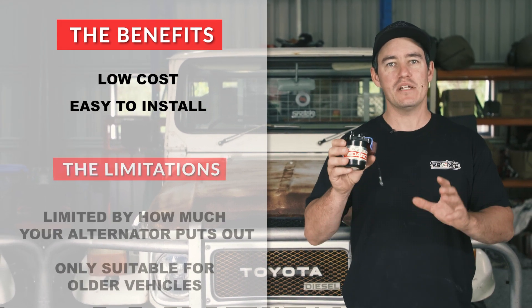If you've only got a basic battery monitor, you're probably wondering how do I tell how much battery power I've got left based on voltage? Here's a really simple and rough guide. Once it reads about 12 volts, your battery is probably about 50% discharged, meaning if it's a regular deep cycle, it'll need charging as soon as possible before risking damage. Once it's reading around 10 to 10.5 volts, your battery is dead flat, and while it'll charge up, it'll never be as good as it was new again.